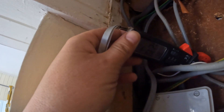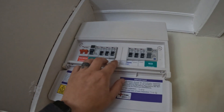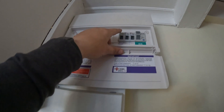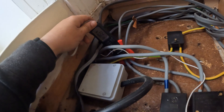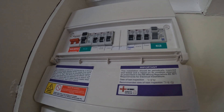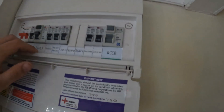I'm seeing 12.7, 12.6 milliamps. Then all I did was go across here and turn off circuit by circuit. I turned off the cooker - that made no difference whatsoever, still reading the same. Then I turned off the outbuilding, which dropped it down to 2 milliamps. So that took off a massive chunk of the earth leakage - that unit over there.